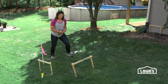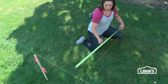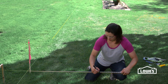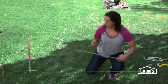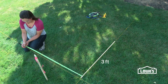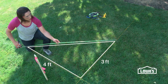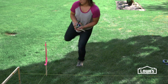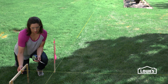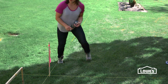Now we'll pull for square and find this corner right here — this right angle. You're going to measure down this line three feet and make a mark. Measure down this line four feet and make another mark. Then your diagonal in between those two marks should be five feet. And if they're not, just adjust your string line on the batter board to either close or open your angle a little bit more. Remember, a little bit goes a long way with that.